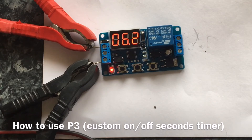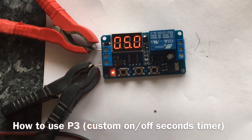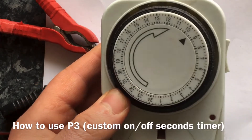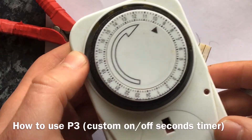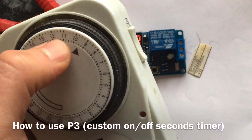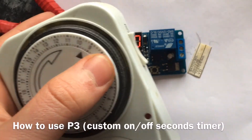That's really handy to make a seconds timer for a small amount of time. It'll go off for a maximum of 16 minutes, meaning it could come on for five seconds every 16 minutes — but that's not what you'll want. You'll want it to just come on once a day, so this is where the analog timer comes in. These are about three pounds. The digital seconds timers online cost around 28 pounds, so it's a significant saving if you can use a seven pound cycle relay in conjunction with this manual timer.